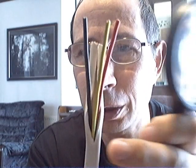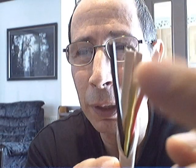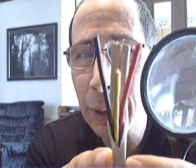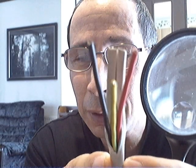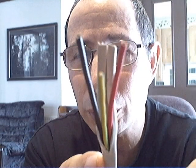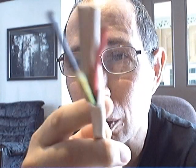But here is red, black, and green and yellow insulation. Now I know initially this could look like a well-fitting green and yellow insulation that's been pushed hard down into the sheath, and it's too thick to be sleeving. I know someone's going to say this video is a scam — that this insulation has been taken off of a flex, because that is sometimes what happens: you use insulation taken off a flex and put it onto the earth when you've got no earth sleeving. That's a good quick fix, nothing wrong with that. But this is not what this is.